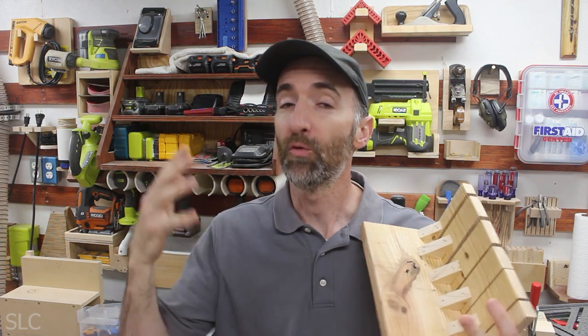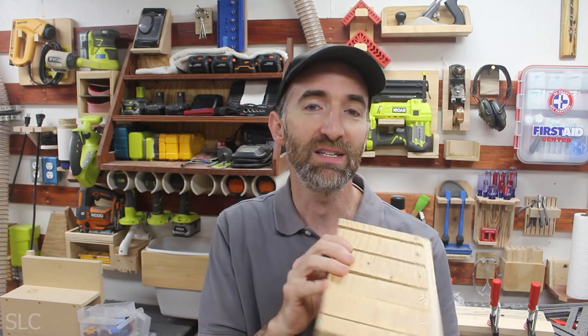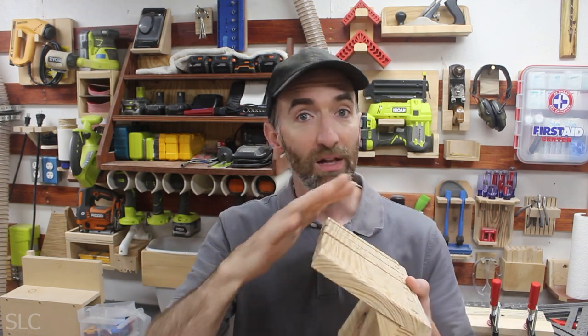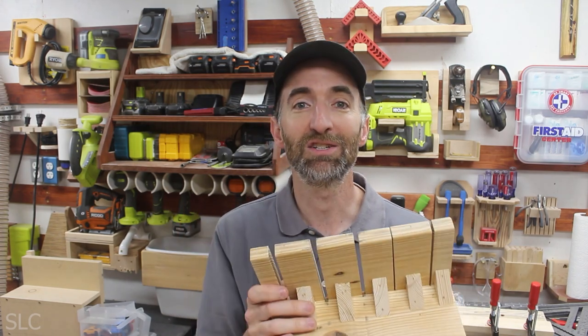In the process of building all my cleats, I didn't take into consideration sometimes what I was putting together. I was trying to build stuff really fast so I could have everything up on the wall. But sometimes you'll have it where your wood starts to warp and gets all wavy. This right here was one of my holders that I'm having to redesign because all my tools sitting on top of it are now a little bit crooked. If you're using solid wood, there's a good chance that will happen more often than if you're using plywood, but plywood can warp over time too. So whatever you're designing, try to keep in mind that you're in an ever-changing climate in your workshop — your temperatures and humidity are going to change. You could always apply a lacquer, polyurethane, or something over your tool holder to help minimize some of that.